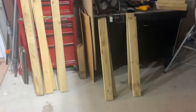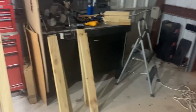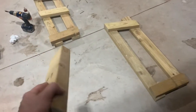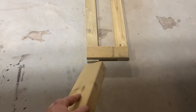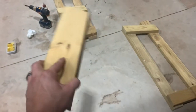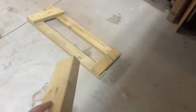If you have bigger weights you'll probably need something closer to 16 to 18 inches deep — just fit it to your size. After making the cuts I start setting this thing up to see how I like it and make sure the bottoms are level. Before screwing everything in, I start by screwing in the top-tier side and bottom-tier side, then figure out where to put the middle tier.